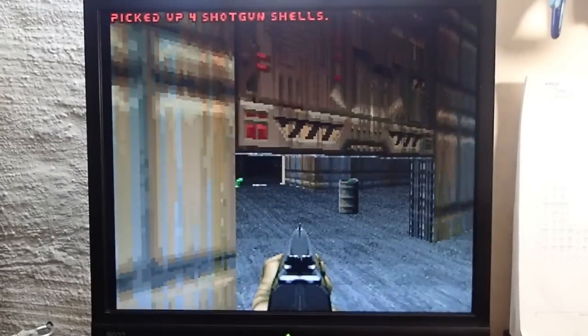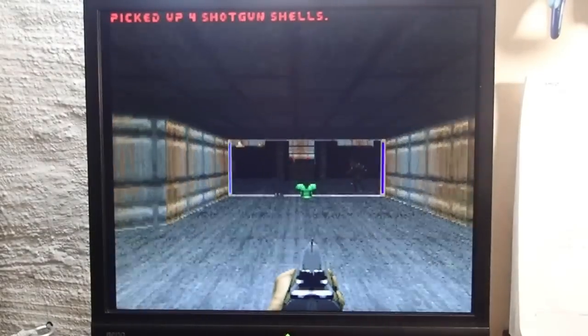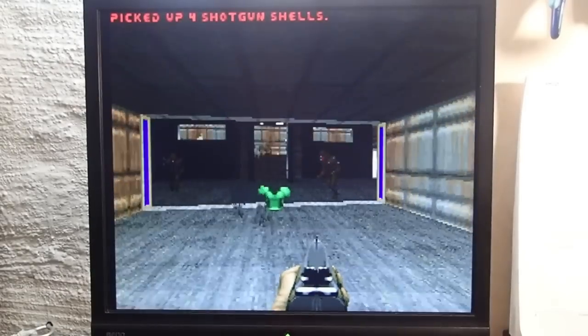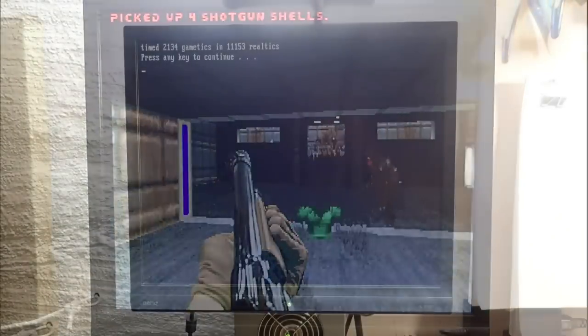I made some tests in the background and even Doom is running. It is a slideshow on the 386, but it is running. I didn't play around with the BIOS settings yet, so they are quite conservative, and the result was over 11,000 ticks. This means 6.8 FPS. Let's call it unplayable, but there is something else I would like to try with this board.